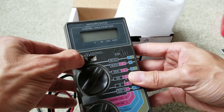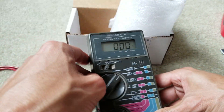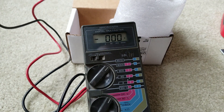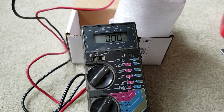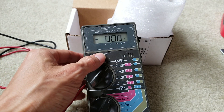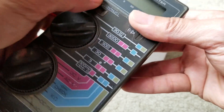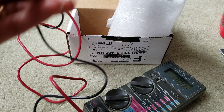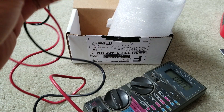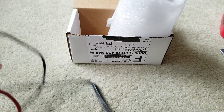My meter is out of battery — are you kidding me? Okay, here we go. With the ohm meter, the needle should jump a little bit and then go back to zero, indicating a good capacitor.